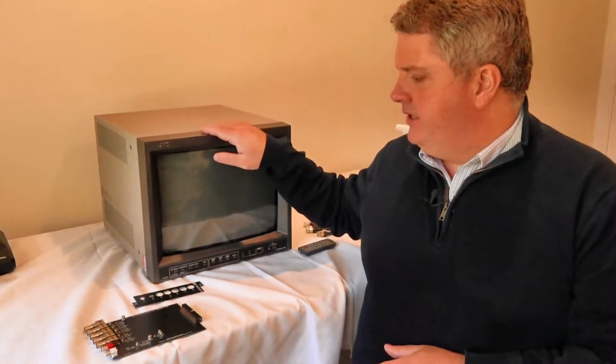Let's just touch on the monitor I'll be using today. This is a TMH150CG, so it's about 750 TVL, which is quite a high resolution monitor. One of the issues with this monitor — or it was an issue back in the day, but it is today when you're trying to play retro video games — is that a lot of people buying these were buying them with SDI cards rather than RGB cards. So trying to find an RGB card for this particular monitor can be quite difficult.